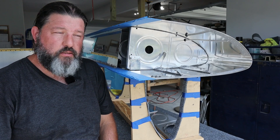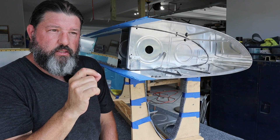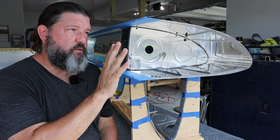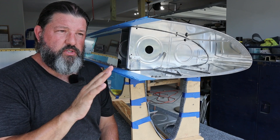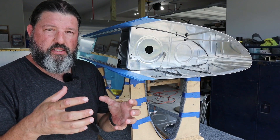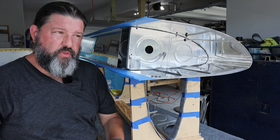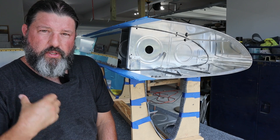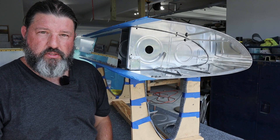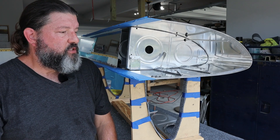If you want to fly 45 seconds upside down, getting fuel isn't enough — you'll also lose oil pressure. So you'd have to put an inverted oil system on your aircraft. The inverted fuel modification is inexpensive and relatively simple and doesn't complicate your life much. An inverted oil system, on the other hand, is very expensive, takes up so much space behind the engine in front of the firewall that it becomes very difficult to work on your airplane. And it doesn't stop there — the seat belts, even with shoulder harnesses, aren't going to cut it. You'll need expensive, uncomfortable ratcheting aerobatic seat belts to keep your head off the ceiling.